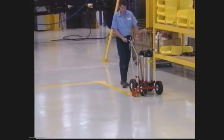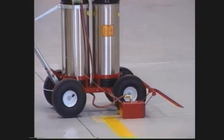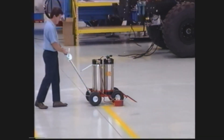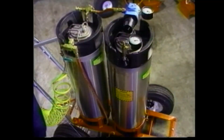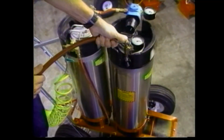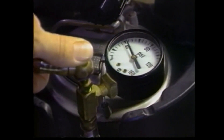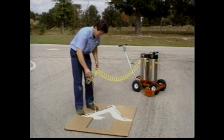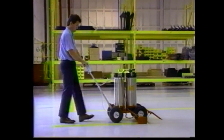The reserve air pressure tank model may be your best choice if you have easy access to an air compressor, either inside your plant or a portable air compressor on your truck. Pressurize the air tank as you would the tire of your car — the air tank holds 120 psi, enough pressure to spray five gallons of paint. Fill the paint tank and the air tank and you're ready for another five gallons.